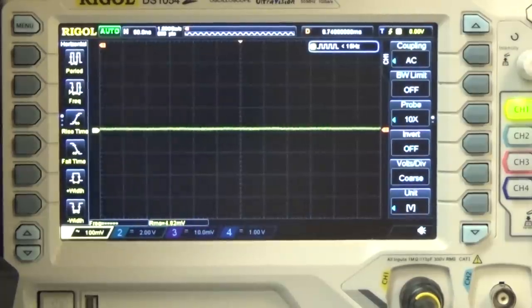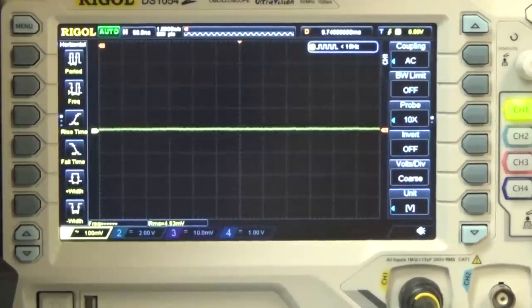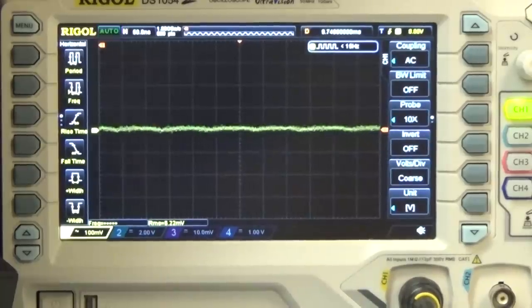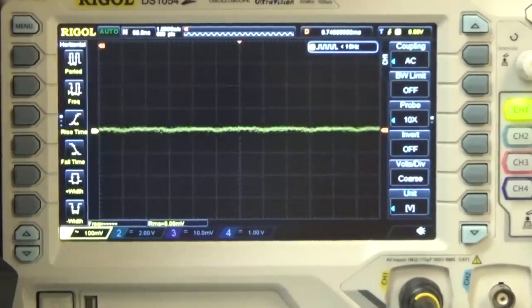Okay, so of course now I go down here with my probe to the ref output, and you see a little bit that there is additional noise on our zero line. You can see that already, but still the radio is switched off, and now let me switch it on, and you hear the click. And the radio is firing up, and then it is going out. So that is our old game. And I'm already down at our ref output, and you see, we do not get our reference frequency out of the radio.